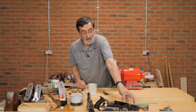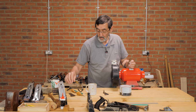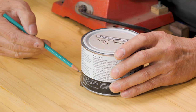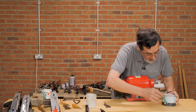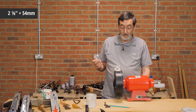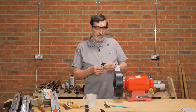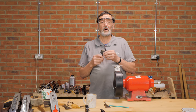This one's never been touched — still got all the authentic rust on it. You don't have to do very much to this, but what you do have to do is create the radius. I'm using this can, equidistancing the gap on each side, and then making a pencil line as a guide — like this. This is a two-and-one-eighth inch radius. I've got my grinder ready; safety is your concern as well as mine, so just wear your safety glasses and make sure you've got all the bells and whistles in place. I'm going to grind this now.